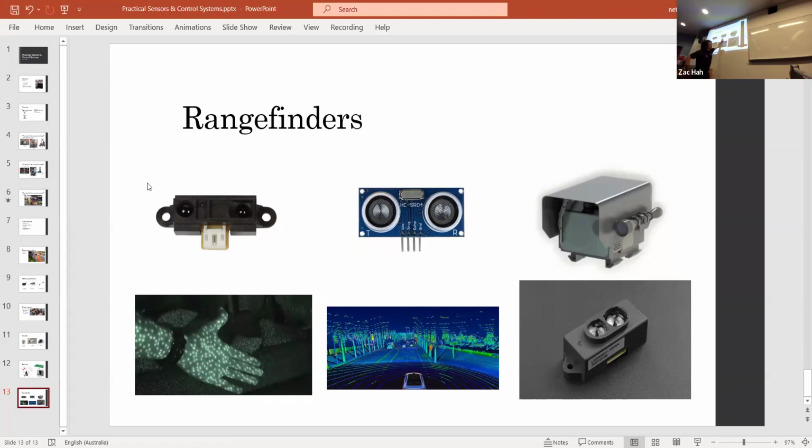That's an ultrasonic sensor. If you've done FLL, you probably know about it. It calculates the time of flight of a ping, kind of like sonar for a submarine. And that kind of time of flight concept gets expanded into LiDAR. So with LiDAR, you have a spinning laser, and it detects a time of flight. This is a time of flight sensor as well. With a spinning time of flight sensor, you can get a 3D map of your environment.